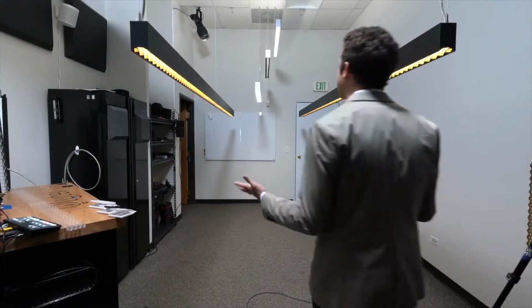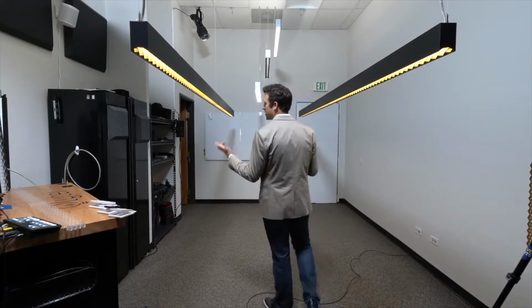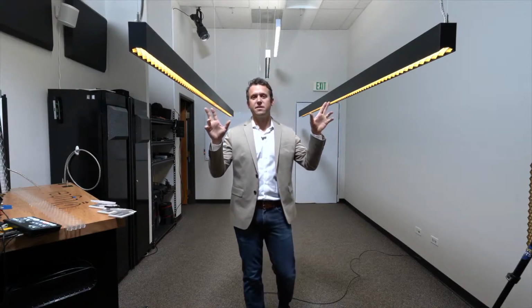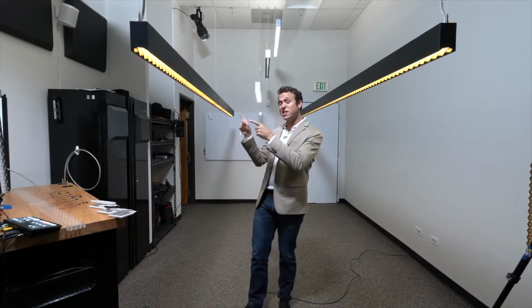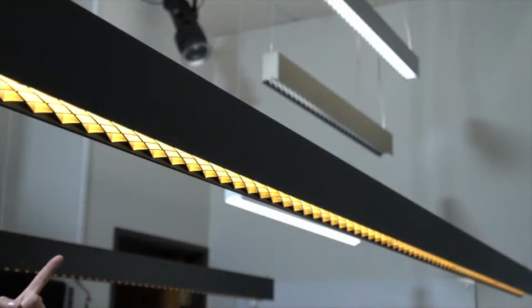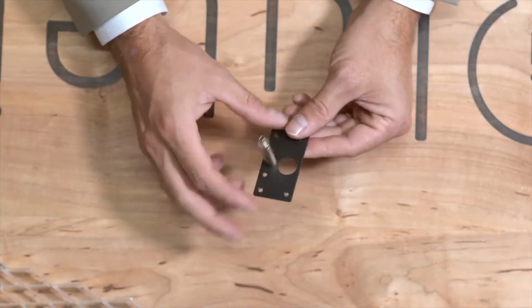All right, so if we look in the space, there's obviously a suspended mounted version, right? We've got these two 12-footers here. And I forgot to mention this earlier, but this 12-footer is actually two 6-foot sections, while that is a single span with just suspension on either end. The suspension connections are typical aircraft cable with grip lock systems.